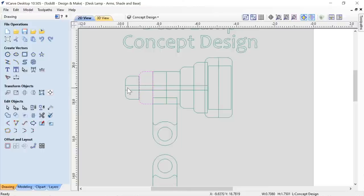I also thought I needed a way to actually assemble these all together, and like I said, I had that pack of dowels, so that was a perfect way of doing that, putting these dowels all together here in the middle so I could center everything up properly. But I knew that these two parts here would be cut all the way through. So in order to get this piece centered on there, I thought if I pocketed out a little spot here and there, then I could have a little lip this would insert into.